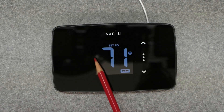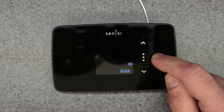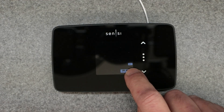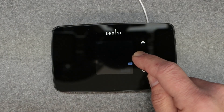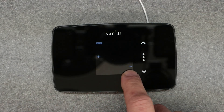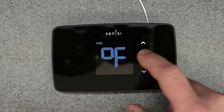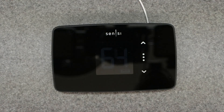As you can see, there's no more wi-fi symbol. To turn it back on, go back to the off position, hold down the three dots, and the wi-fi frequency symbol shows up again. Toggle it back on, hit the mode button to cycle through, and you're back to normal operation. It's worth mentioning that if you want long-term manual use, it's best to turn off the wi-fi.